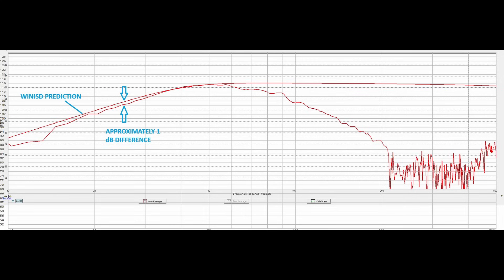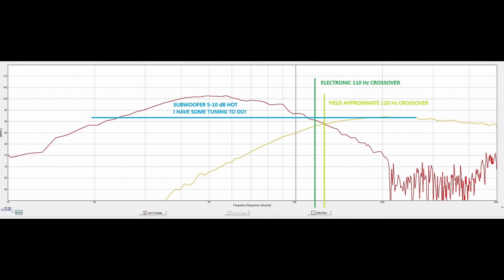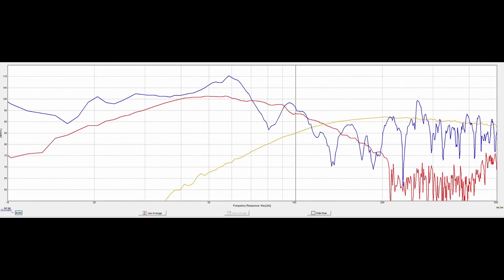Collectively we're about two decibels down from the manufacturer's WinISD response, so keep that in mind. This yellow line here is my right speaker — I used a 110 Hz crossover on my AVR, but it came up with about 120 Hz in the real world because the subwoofer is running a bit too hot, which is okay. Here's the in-room response. There are a few things to talk about: first, a bunch of dips starting at 80 Hz, and then around 140 Hz, and so on all the way up. This is quite normal — this is what happens in rooms, especially a room like mine where I have no absorption. I don't even have a couch in this room yet, so I'm going to let that slide for now.